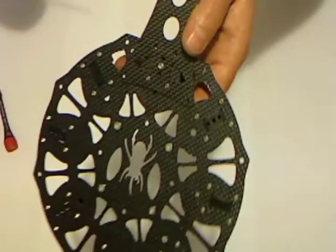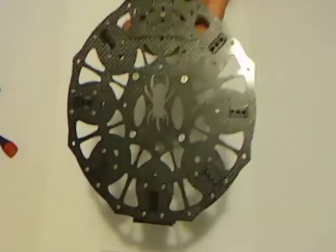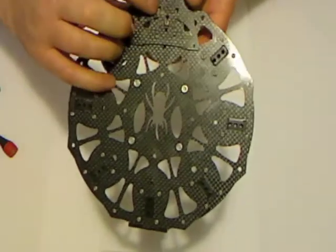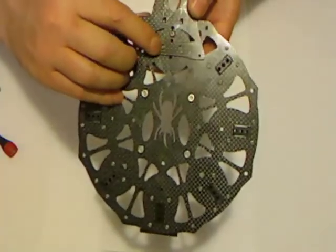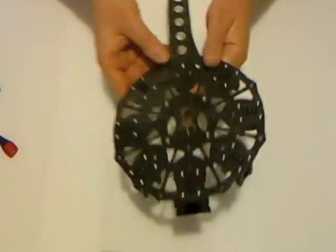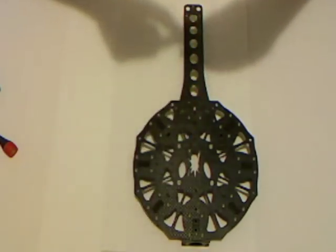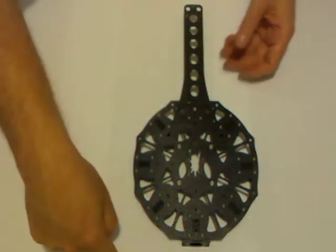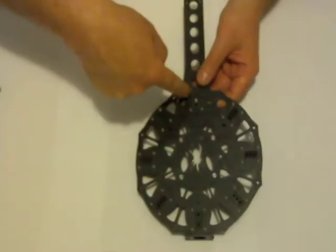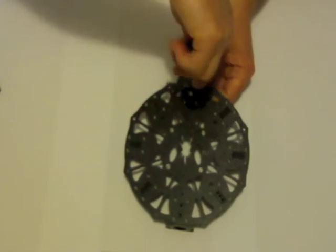Okay, now you'll also notice that these 4 screw holes here are actually clearance holes. So that's sitting over the top of those screws I've already done. Right, so that's why there's also these washers supplied for the other pair of screws. So I use the washer on the screws that go at the outer pins, so that I'm also using that washer to grab the pin.